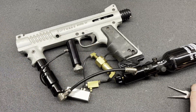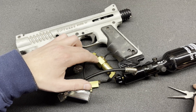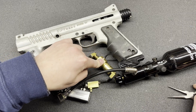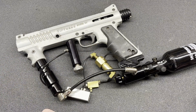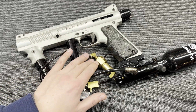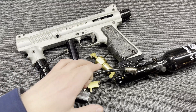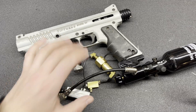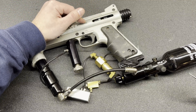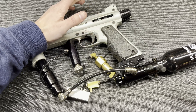The end result is this will probably be condensed down into a single unit. The general flow: this main component, the pulse valve, is designed so when a supply of air is presented to the input, a single pulse will go out the output. However, this is designed for industrial purposes — that pulse is roughly 100 milliseconds. For a RAM system, 100 milliseconds is way too long. We're looking more around 12 milliseconds.